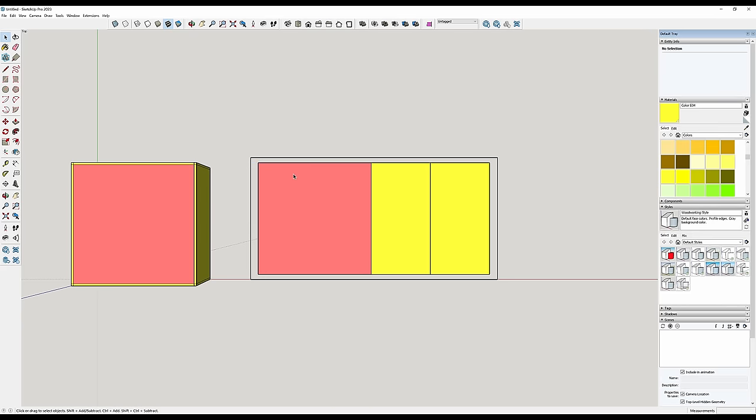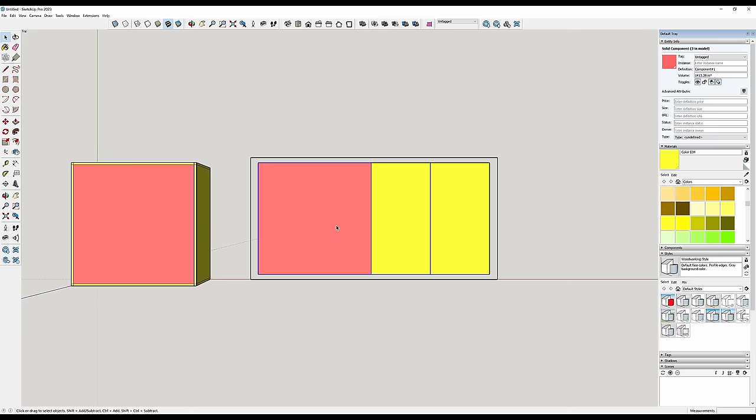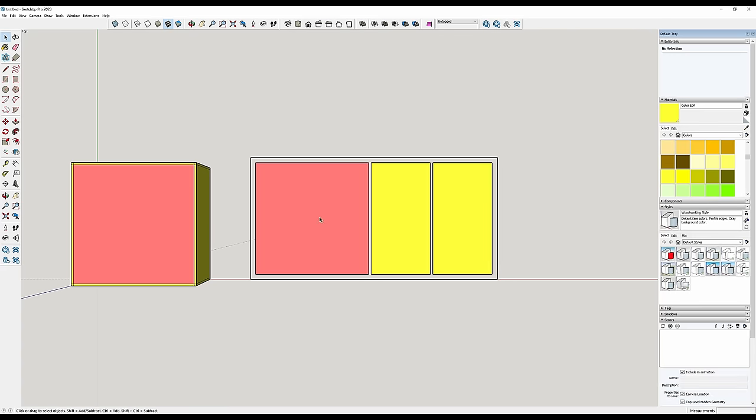And the reason why this is convenient for this to not take up a full sheet is because I'm going to cut this out on the CNC just for the box joints, and I need the corners available to screw this piece of plywood or Advantech flooring to my machine. Also, I can't go the full width anyway because Advantech comes in tongue and groove, the long edges on Advantech flooring are tongue and groove, long, narrow faces. So let's move this over, say 1 inch, enter, grab this, move this over 1 inch. Yeah, that's plenty enough room. That's all I really need to do.